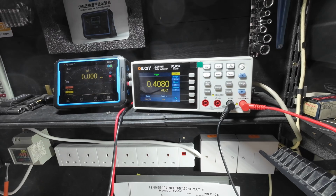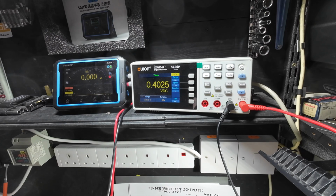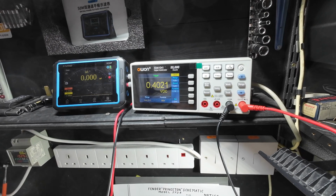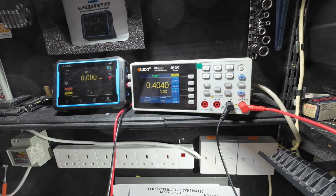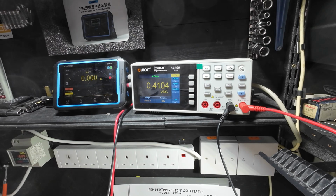We weren't getting any HT voltage because I'd wired the filament and the HT feed to pin 7 on the rectifier socket instead of pin 8 because I'm a plank, and that's the first plank moment of the week, and it's only Monday dinner time.